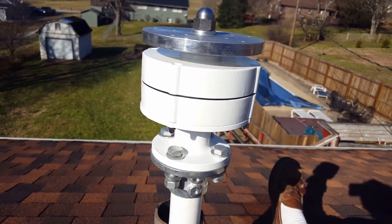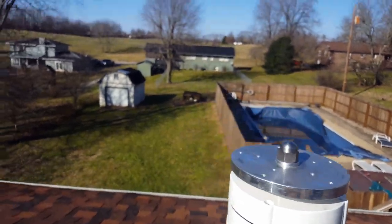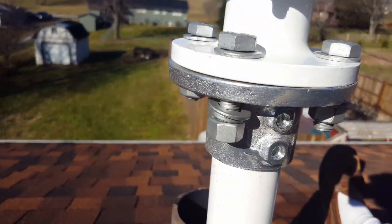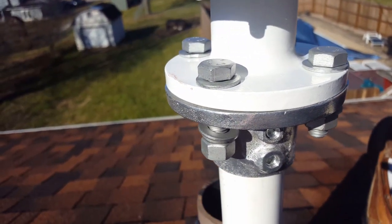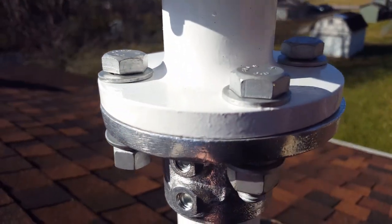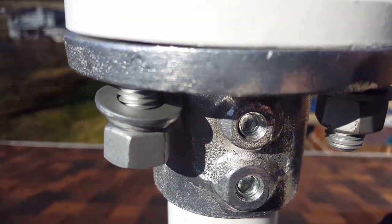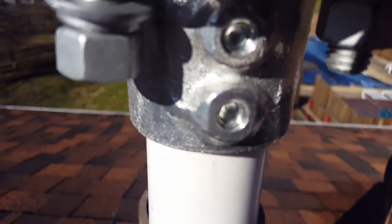I'm installing the Chinese wind turbine. One thing I wanted to show you: as I'm mounting it here on my roof — I have to because I can't put a pole or anything. I'm in a residential area and that's forbidden, so I've got to put it on my roof. This bracket right here is what I wanted to talk about. I'll put a link below where you can find it, because this fits this mount perfectly on these Chinese turbines. It goes over a one and a half inch pipe, preferably metal, although I'm using PVC just because I need to screw this in.